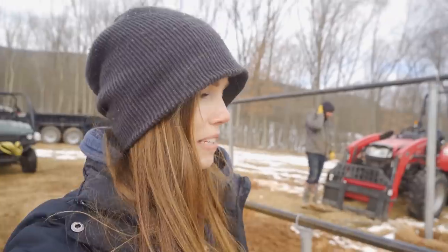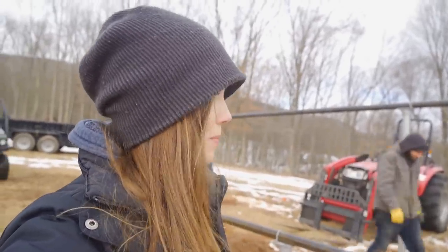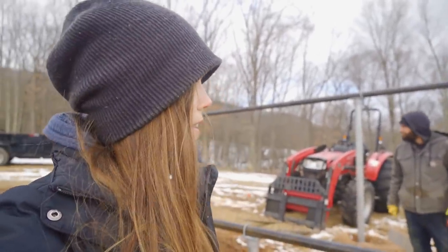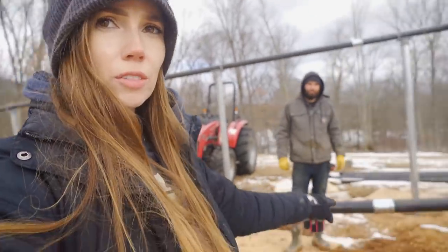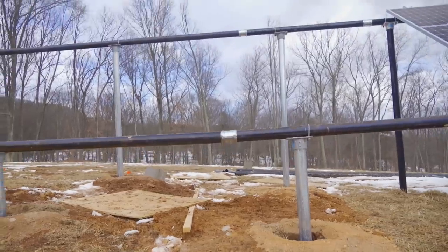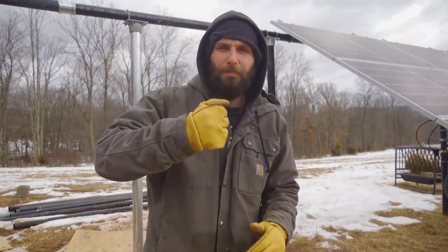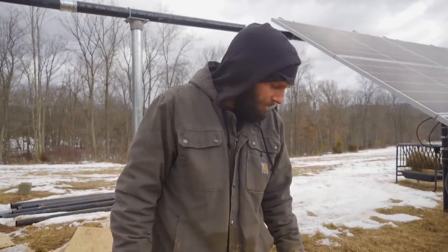So we messed up. We got all of the pipes in place, as you guys saw, everything connected together and temporarily bolted down. And we're out here looking at it and we could see that this part right here, your belly right here, it dips down. I guess when we measured it, we must have had the tape measure on a high spot when we did it with the transit. We're probably about 2 inches low, I imagine.